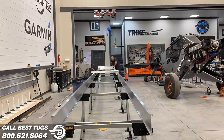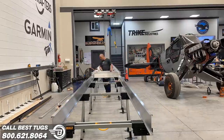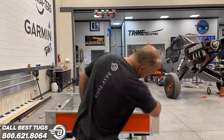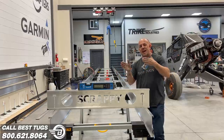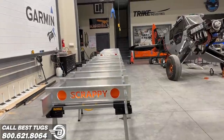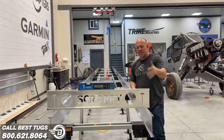My table ribs can slide up and down the length of my table spars. The reason for that is because I want to be able to get underneath the wing to put in all the rivets — there's always going to be one of your table blocks in your way to get underneath to your skin to buck your rivets. At any point I can grab one and slide it out of my way from under the table and work, then slide it back. The rib moves with the twist of the wing no matter where I place it, and the wing sits on an absolutely perfect hard surface the whole way down.